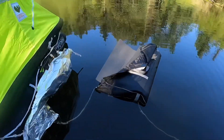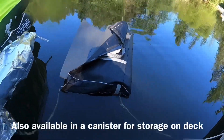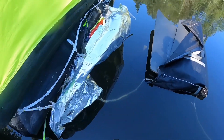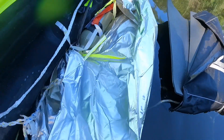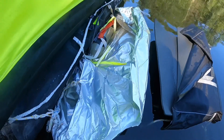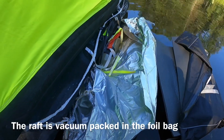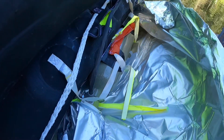Other things going on here — as you can see, this bag is still attached to the painter. In fact, the painter goes through the bag. Follow the painter and you can see this big mess. There's a foil bag here — this foil bag is used in some of the newer life rafts and it actually enables them to last for up to three years without repacking. And here is the CO2 canister which inflates the raft.